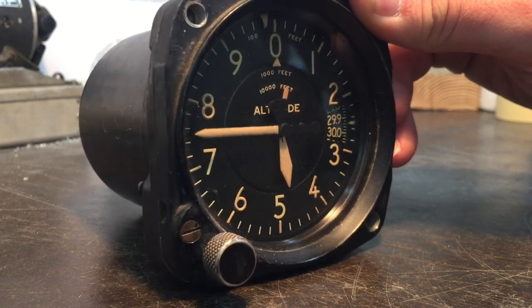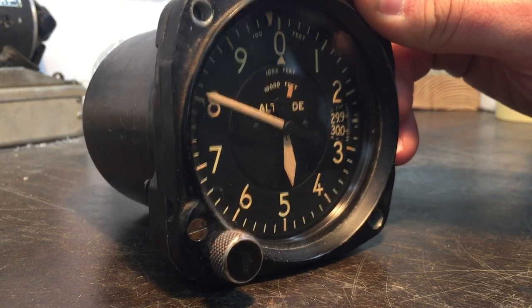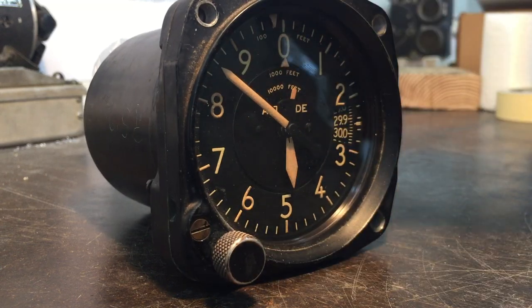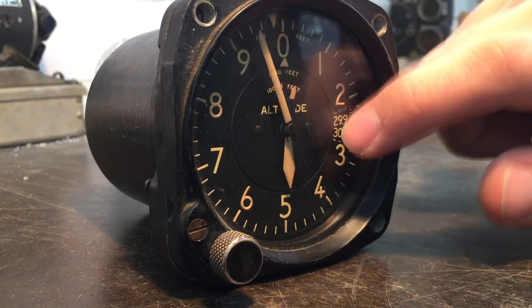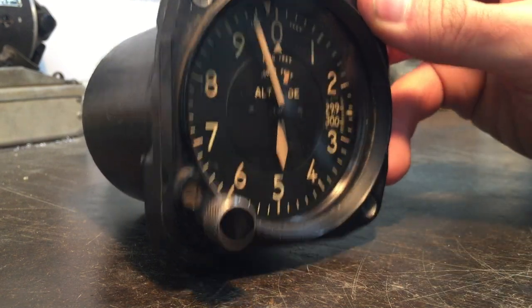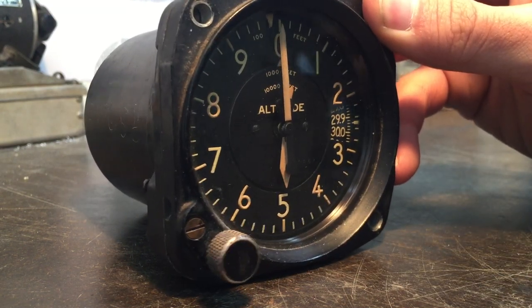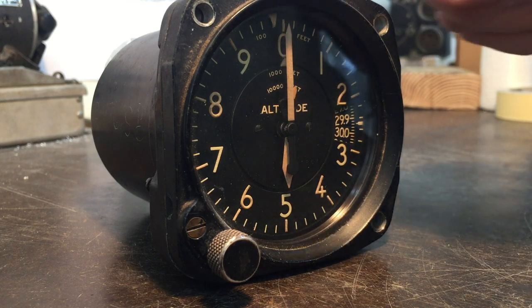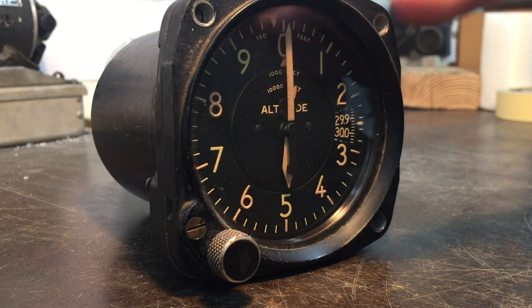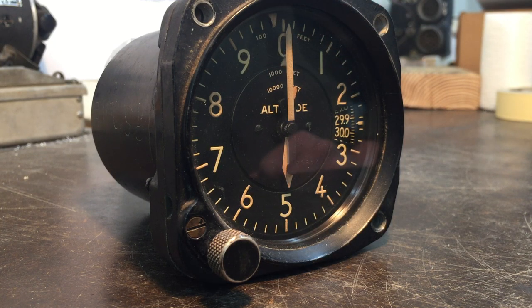More tapping and it will actually return, then we hit the lower friction area and resume normal tapping. I believe that before instruments are installed in an aircraft they have to pass what's called the friction test — that exact same thing. When you tap on it, that needle should not jump more than 10 to 40 feet, depending on the altitude reading you're currently at.